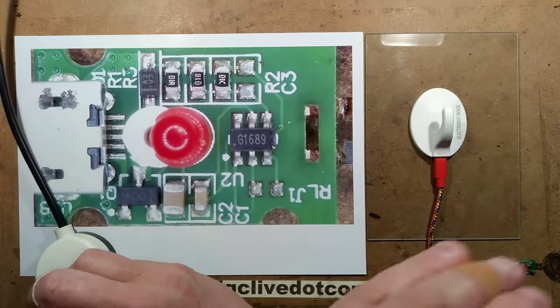I couldn't identify the mystery chip number - I think it's either a microcontroller or a custom chip. The circuitry is very simple: a transistor for switching, a reservoir capacitor as the memory, a decoupling capacitor for chip stability, a diode for supply isolation, an LED resistor, a resistor on an input pin to detect power interruption, and a third resistor possibly for timing or fine-tuning for different materials - but that's a wild guess. It's an interesting concept I'd never come across before, and it kind of works - but it may leave a skid mark on your wall.